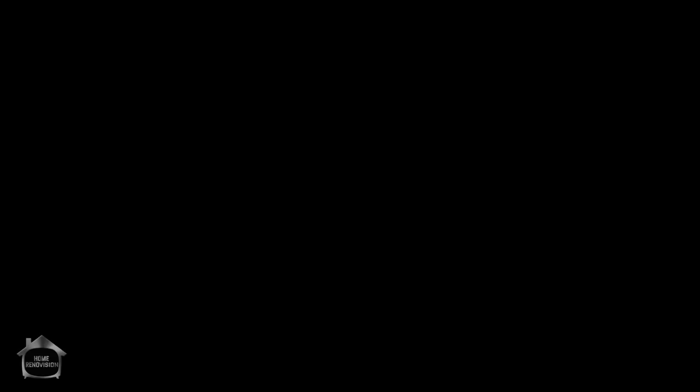With semi-gloss you're doing all your trim — all your windows, baseboards, doors — all those washable surfaces that need regular maintenance. Semi-gloss paint is even more durable than eggshell, so when you're sweeping and vacuuming and hit the baseboards you don't even leave a mark. Here's the last paint — this is the flat or matte paint in the same formulation. We use this on the ceiling and you can contrast the ceiling, have a nice dark tone, move into the crown molding, and it just makes the room pop — a great way to get a really sophisticated look.